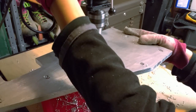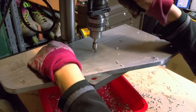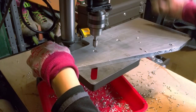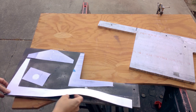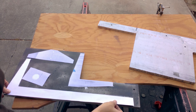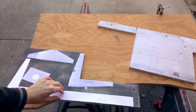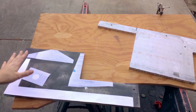I'm going to give all the holes a light counter sinking - I tend to give it a brief but somewhat firm pass. I sprayed a little quick-drying lacquer spray paint on this rather than magic markers around all the edges. Unfortunately it doesn't stand really well. These are the templates for these parts. I measured the overall length to make sure they're okay and also doctored up any square edges I can with the steel squares.